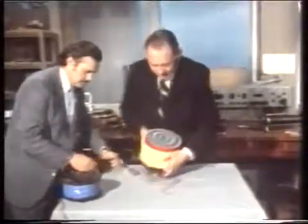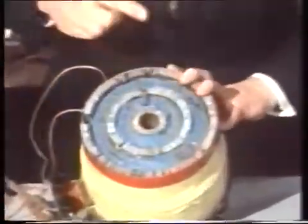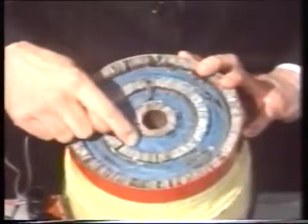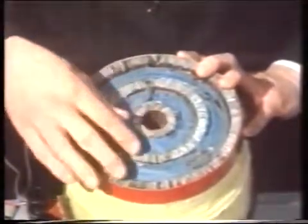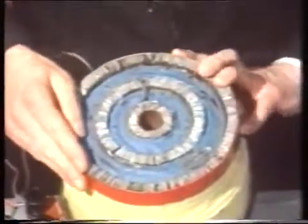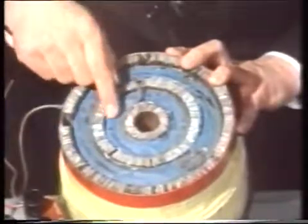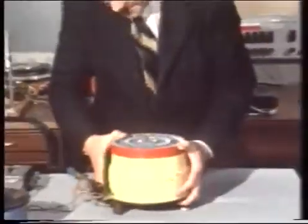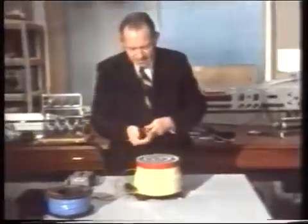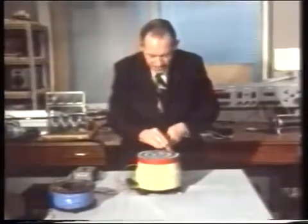Instead of a single coil, I'm going to use two coils, one inside the other. This is a coil, and this is a coil. And these three rings are steel rings — they're to help strengthen the magnetic field. We've found that we can produce this inward travelling field if we make the current in this coil go one way round at the same time as the current in the other goes the other way round. When we put both coils on together, we can detect with the copper cylinder a very slight tendency to produce inward travelling fields — that is, the bottom of the cylinder moving towards the centre.